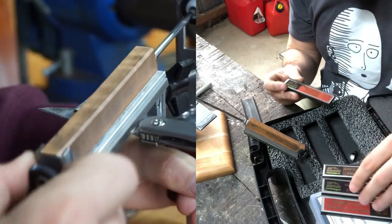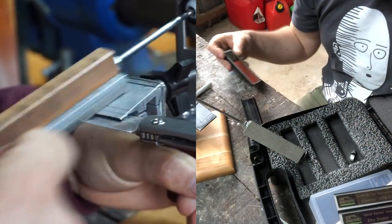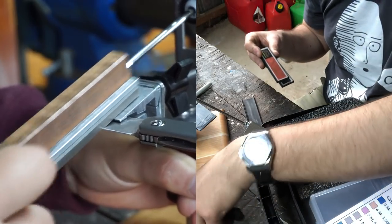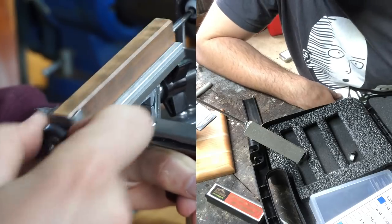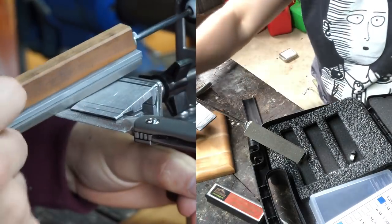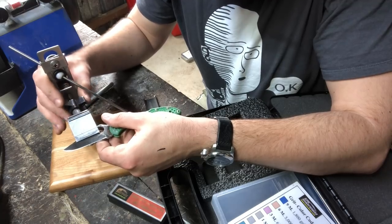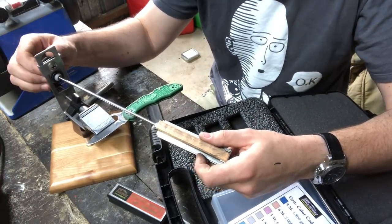My system came with the diamond stones. I'd suggest diamonds are best for the average user — they work quicker and quite neatly, especially up to the extra fine 1500 grit. The basic KME kit comes with 140, 300, 600, and 1500 grit. I recommend getting the Beast stone at 50 grit as well if you're working with super steels — it removes material noticeably quicker — and a 100 grit stone to ensure your scratch progressions are overtaken smoothly when chasing a mirror finish.